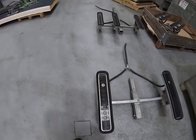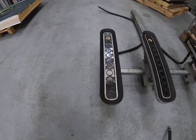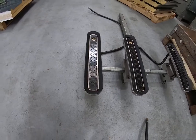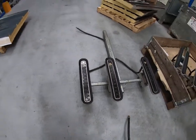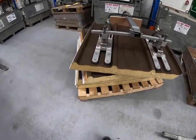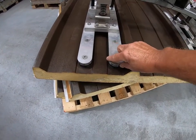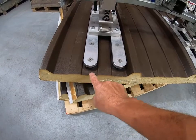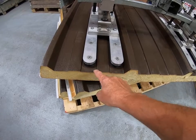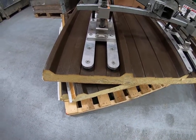If you're lifting King Zip, for example, you'll need suction pads where the width is specially designed to go between the stiffening ribs on a King Zip panel. If you're lifting Stedman AS35 panels, you'll receive these highly specialized SP14 suction pads, which are very narrow and designed to go between the stiffening ribs on a Stedman AS35 panel. The shoulders of the stiffening ribs on the AS35 are too tight for normal seals to seal over them.